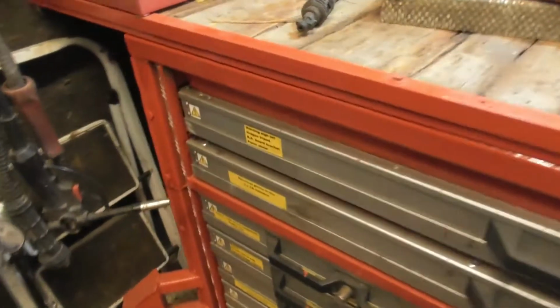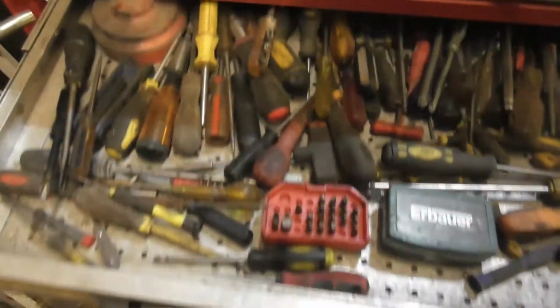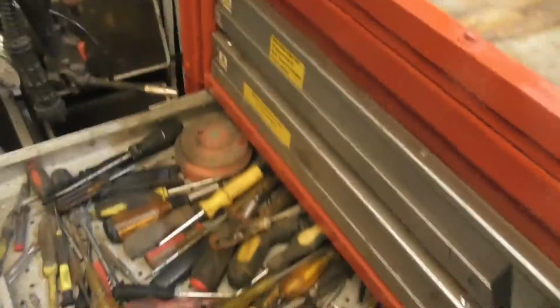Yeah, I know what's just happened. The block at the, yeah, there you go, look, it's flattened it. They're so heavy, these things, it's just flattened it. So yeah, we need to put a tiny bit of angle iron behind there just to stop that from going any further through.